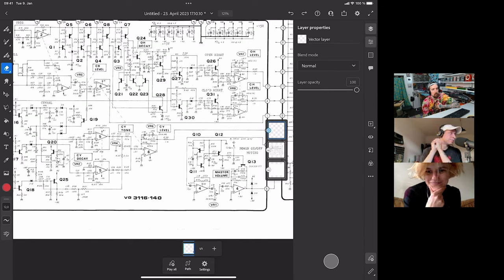I did that once. I took my filter design with the diodes and replaced the diodes with LEDs, because everyone in the comments said that should work. The problem is that regular diodes are generally in the same ballpark when it comes to forward voltage drop. What I had to learn the hard way about LEDs is that they differ wildly. One LED will turn on at 1.2 volts and another at 1.5 volts. My design implicitly relies on the diodes all having a similar forward voltage drop. With the LEDs it did work, but it sounded really funky and strange, with weird artifacts in the sound, and it was very clicky. But it looked nice, because as soon as the filter got activated, it lit up. So that was cool.